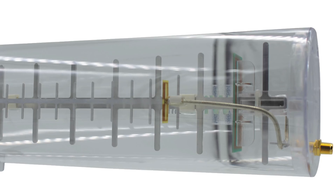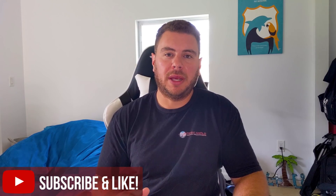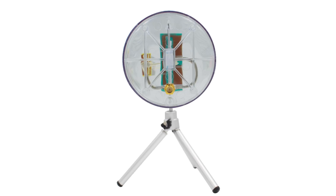What's special about this antenna is there are actually two antennas in a single housing. It's 2.4 gigahertz, which is our older legacy model — the longer version — and that's what gives us the 17-element spacing. Next to it, we put a miniaturized version of that, which allows for the 5 gigahertz band.